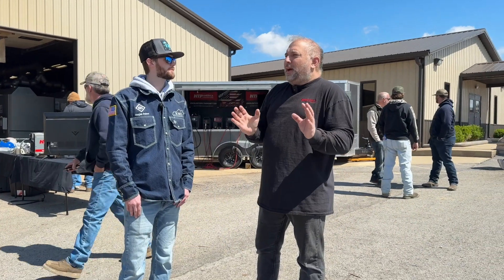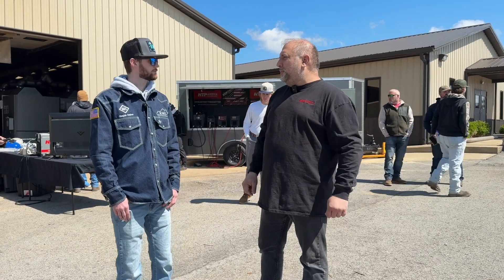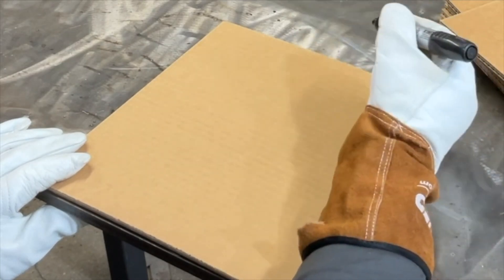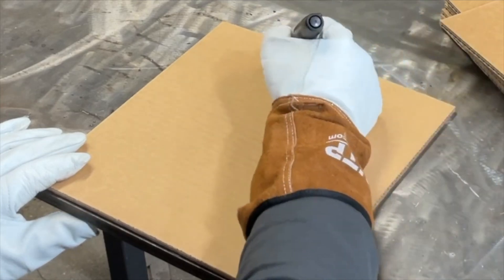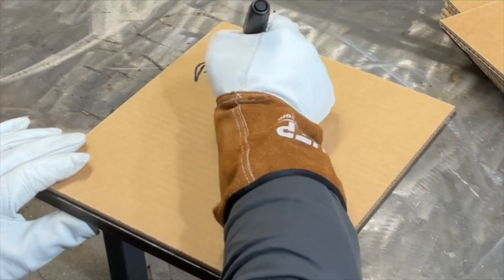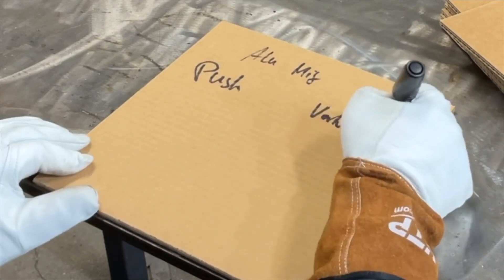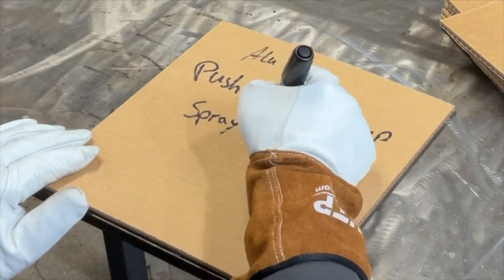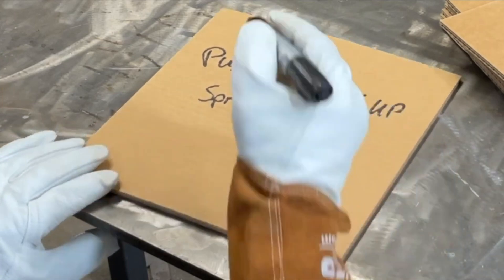I do those little explanations with a piece of cardboard and a sharpie, making drawings to break these concepts down. Aluminum MIG is always a spray arc application — there really is no short circuit in aluminum MIG. It's always push the weld, always vertical up, never down, and it's always a spray arc. It can also be a pulse spray arc — the same concept applies.